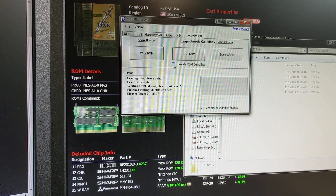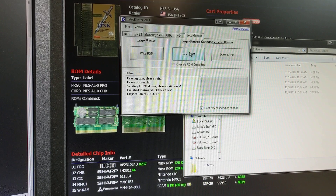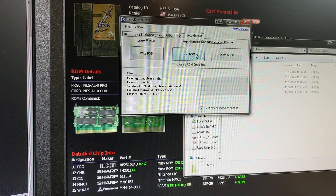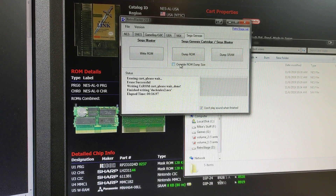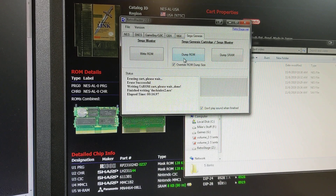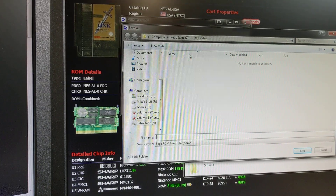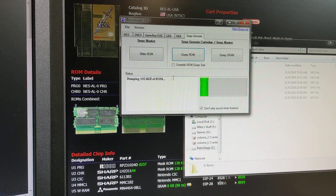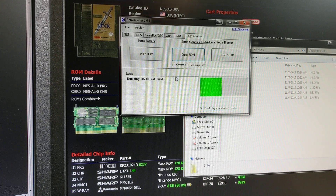When you're dumping a game for Sega Genesis, I've got it set up so it reads the internal header of the game to see how large the game is supposed to be and dumps it based on that number. But if you wanted to only dump, say, one megabyte of a four megabyte file, you could override the ROM dump size, click Dump ROM, and then it'll ask you how big you wanted the dump to be. In this case I want to just dump the game as it is, so we're going to go Dump ROM. This is Sonic 2 — it tells us it's a one megabyte file, so it's going to dump 1,024 kilobytes of ROM.